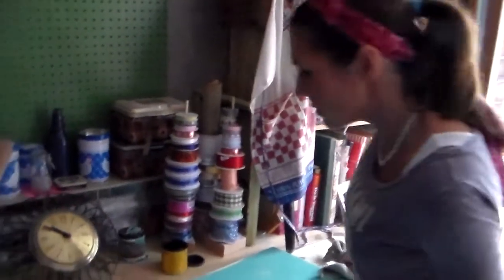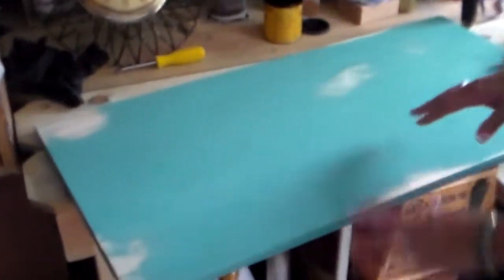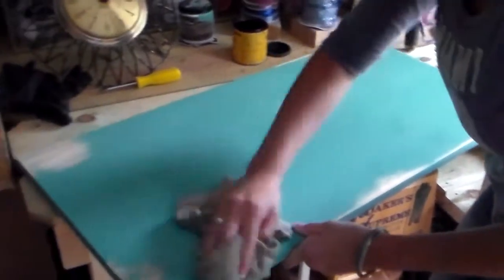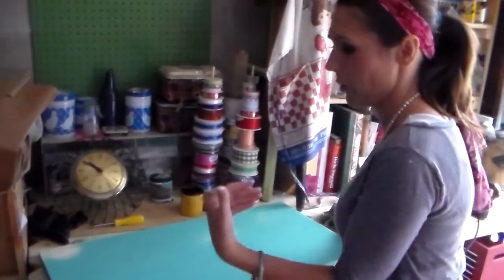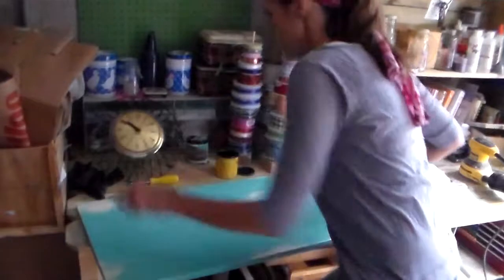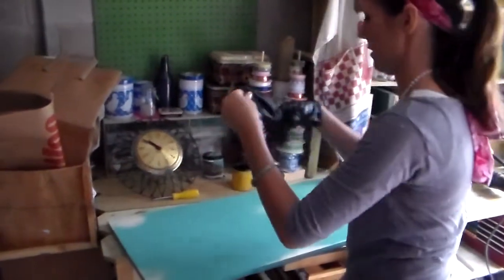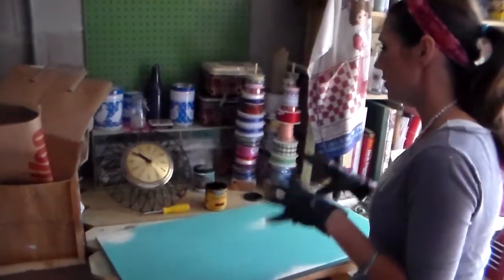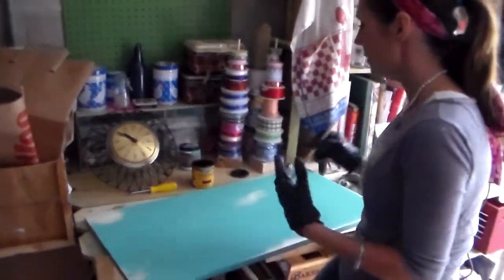We're all done with that part. As you can see, I didn't do too much — I just picked a few pieces around the edge and did a little bit in the center. Even the stuff that doesn't show up now will still show up when we go to stain it. I'm going to take my rag and just wipe it free of all that loose sawdust. If you painted this two colors, this is where your other color would be showing through, and as you continue to sand, you'll get your natural wood color as well — giving you really three different colors. Now I'm going to put on my gloves because we're going to be adding the stain. I've picked a walnut color stain — the darker the better. With oak or lighter colored stains, it really doesn't show up well on these projects to give them that older look, so I recommend a dark walnut color.